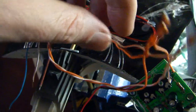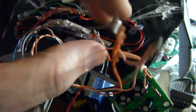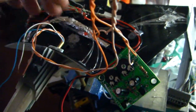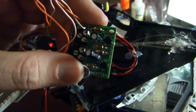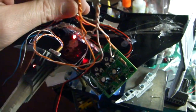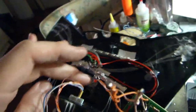So now the next thing to do is glue, epoxy this one in place and put some tool dip on the exposed leads like these right here, and get this all set up to mount this little board down inside the hull with a little bit of low temp, very cool low temp hot glue, and it'll be ready to go. After that, I can go ahead and wire up to the leads all the fiber optic emitters, the back LED piece, and run some wiring up the pipe and get it all bundled up.